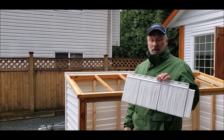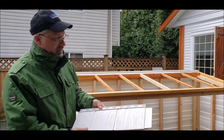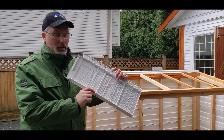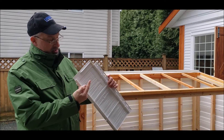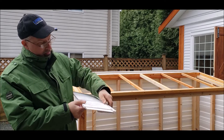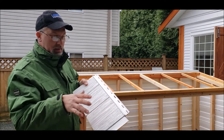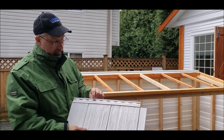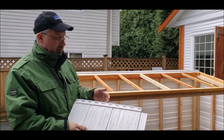This is the product right here — it's very much like vinyl siding in the way that you apply it. It has a ridge on the back that catches a slot right here. That's how they fit together and don't pop out, and then you nail the top in, just like you would vinyl siding.